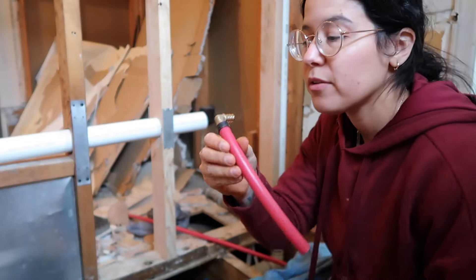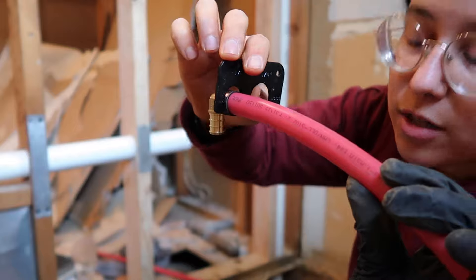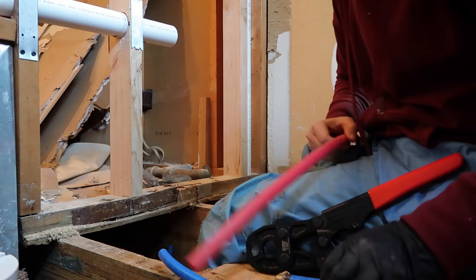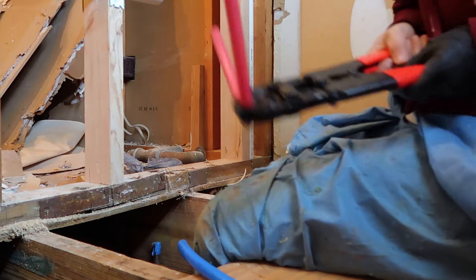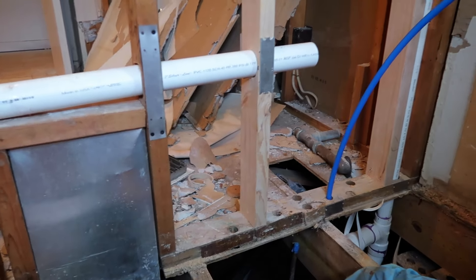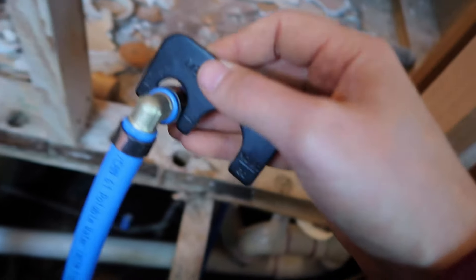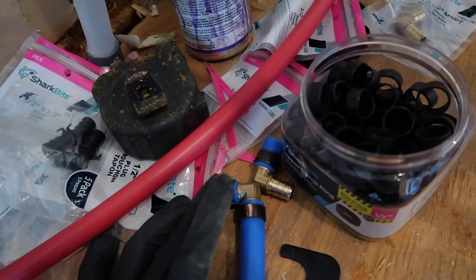I think I messed up the first one but I got the second one good, and it comes with this little go/no-go gadget. According to the instructions, 50% down the PEX is exactly where we want to be, so we are good to go. Honestly the hardest part is getting the ring not to slip. I had to adjust the jaws over here — it is so tight I literally think I just pulled a shoulder muscle — but I did figure it out and we did get a little cold water line in here. The last little bit with these chompers is so freaking difficult. We're right there at the halfway mark. I had to go through a couple fittings to get everything figured out, but I have a removal tool so I'll be able to save these.